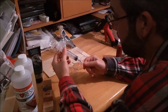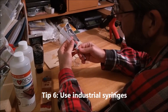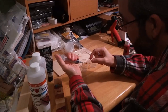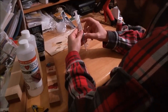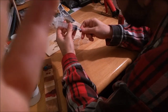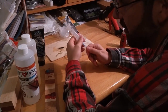If you're going to be doing CNC inlays, having an industrial syringe - this is a 20-milliliter syringe - is fantastic. You can put the nozzle on and it's precise but big enough to push out epoxy at a decent rate. It also lets you precisely measure: pull out exactly so many milliliters to help get that 50-50 mixture just right. Nice containers and industrial syringes are something worth investing in if you're doing this.